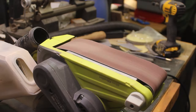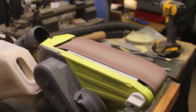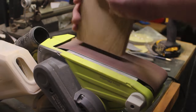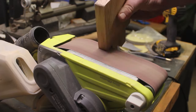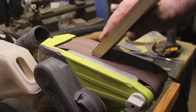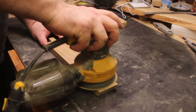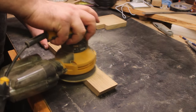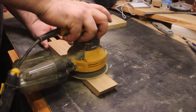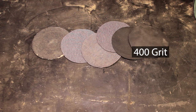At this point all of the parts are cut out, so we can turn our attention to some sanding. The first thing I did was use the belt sander just to go over all the parts — I'm also using it to round over the corners and do some final detail shaping on the top of the lamp piece, and also to create the right angle for the upright. After this it's onto the random orbit sander to create a finished surface on all pieces. In order to get that nice finish it's important to use a range of sandpaper grits — in this instance I used 80, 120, 180, 220, 320, and 400 grit.